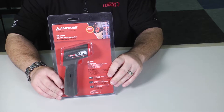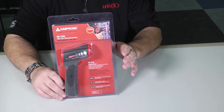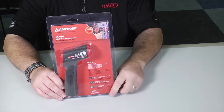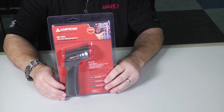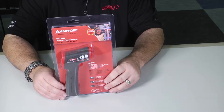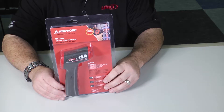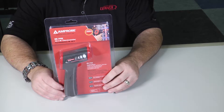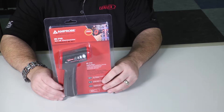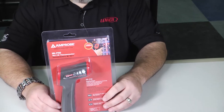There's a lot of talk about these and a lot of guys who use them. I think they're a good product if used properly, but what I see a lot in the field is people using them improperly. So first let's talk about what this thermometer will do. The IR710 has a temperature range of 0 to 716 degrees Fahrenheit, accuracy of plus or minus 2%, a min-max setting, and an emissivity setting of 0.95.